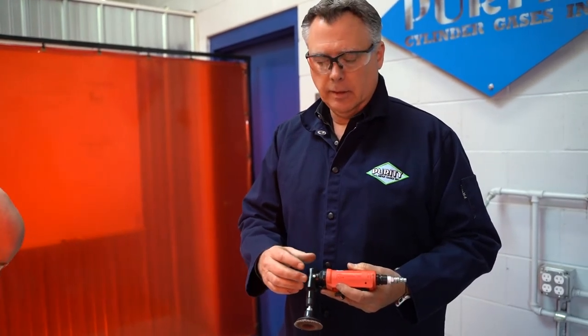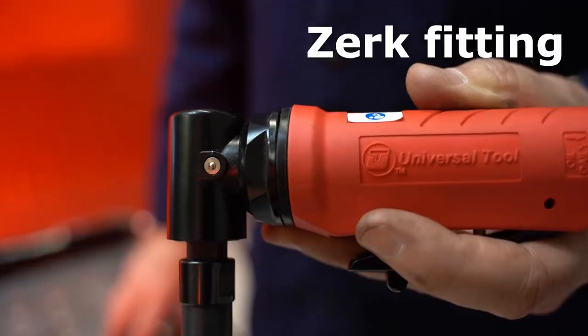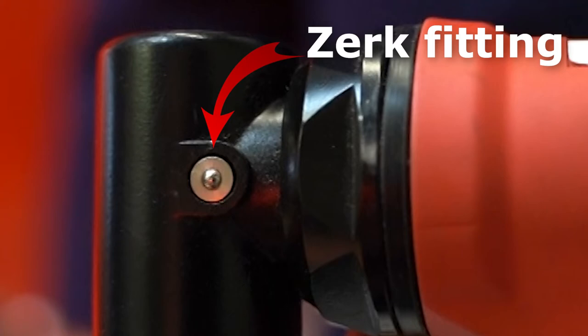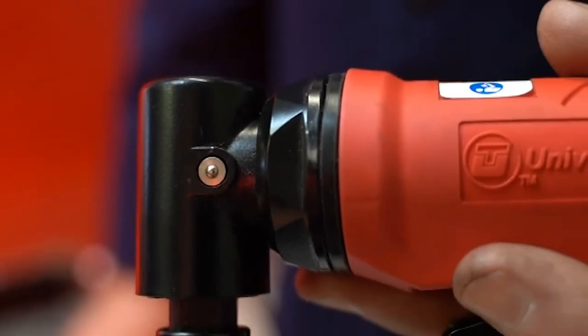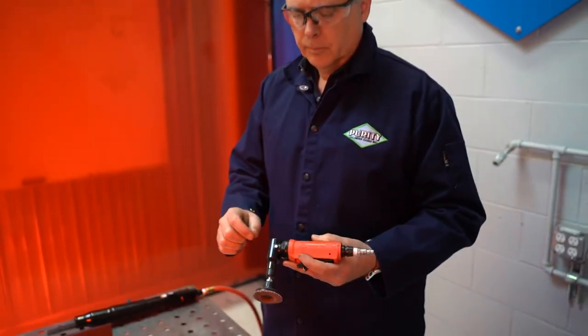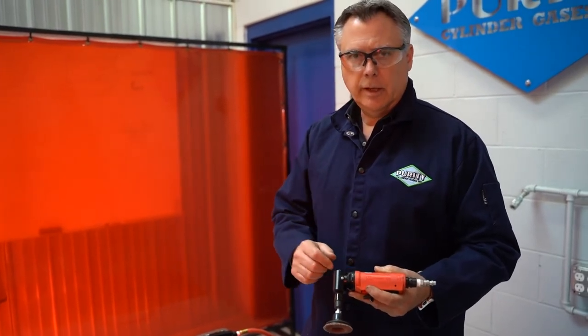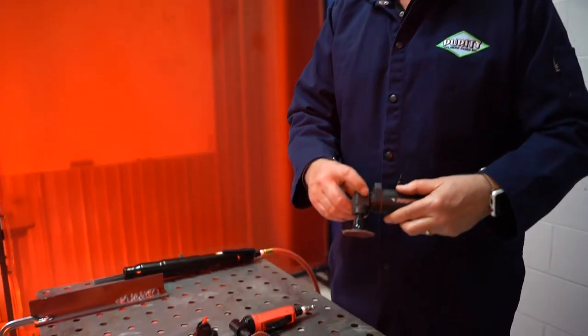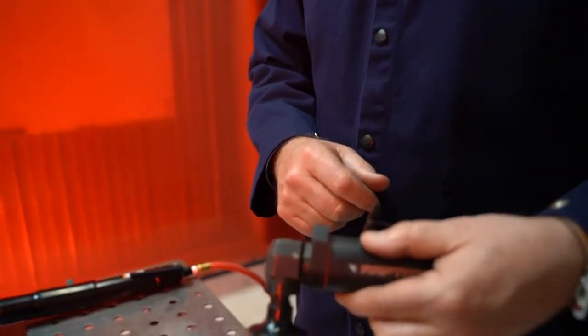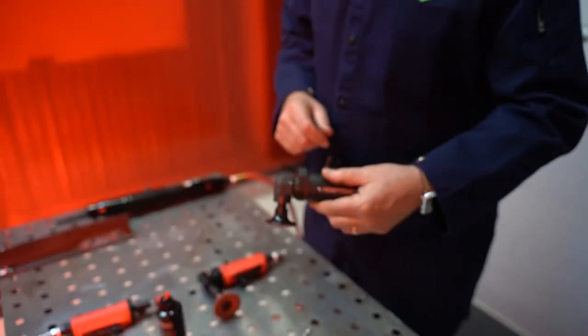In addition to that, you'll have a right angle gear set that needs lubrication — there's grease required to go in this head. So how do you get the grease in there? That's a little zerk fitting — a spring-loaded ball bearing fitting. You take a standard grease gun with a needle type nozzle that pushes in that ball bearing and allows you to pump grease into the head. Every tool with gears will have a similar type zerk fitting, and you'll also find it on other tools like impact wrenches and other grinders.